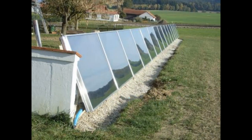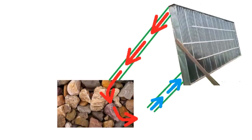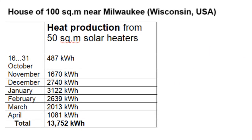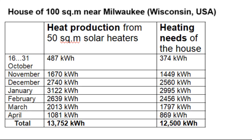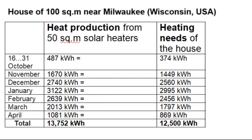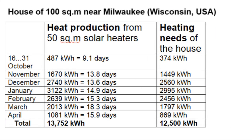50 m² of our solar heaters should form two or one long roll, and this is a box with 27 tons of stones. During sunny hours, this first fan circulates air so that the hot stones receive heat from the solar heaters during almost 7 months of the heating season. This thermal energy completely covers the heating needs of the house when this second fan creates circulation of room air during cloudy hours and at night. This is the number of sunny days according to Milwaukee's climate.